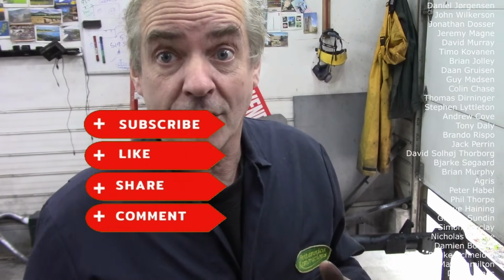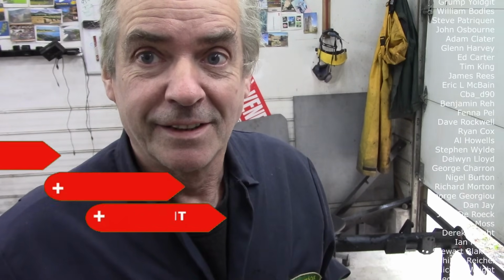So that can show you just how you can rectify a problem if you've been welding an axle or you've got a bent axle. You can keep doing this over and over again and getting those flanges to go. Let me get the camera. So originally it was like that, so now we've pulled it. Oh, wait a minute, it's tight at the top, that's right. So it was tight at the top. So what we've done is we've pulled it in and contracted underneath and pulled them square again. Saved a fortune, hasn't it?